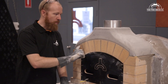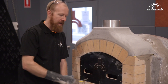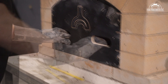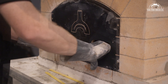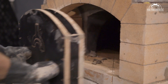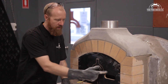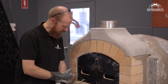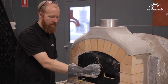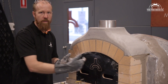If your vent arch bricks have been set for at least 12 hours, you can now remove your formwork. It's nice and simple — all you have to do is pull out the plastic strips, the formwork will then drop down by about 3mm, and then you can gently slide it out. If you find it gets stuck and doesn't want to move, don't try and bash it out — just undo the Phillips head screws holding it at the front. As soon as you remove those, that part will just fall out and then you can give the back a little tap to get it out as well.